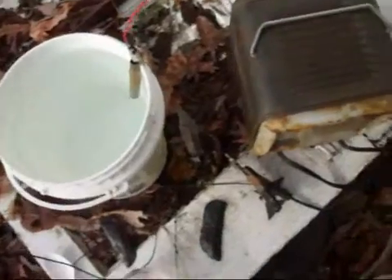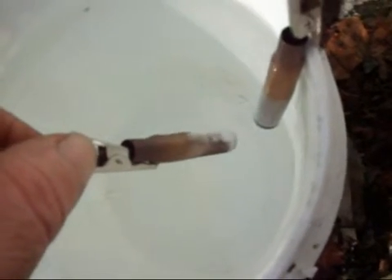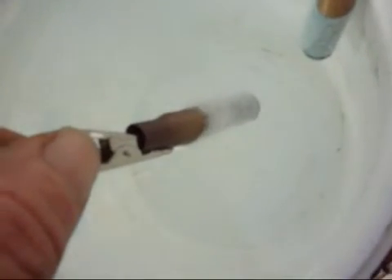Just as a test to show you that it should work — those were the graphite electrodes. What I got here is two empty brass casings from a rifle. If I hold them together, watch how quick — see how quick those bubbles come off of that one? That's the negative side, that's the hydrogen. Brass is acting as an electrode. See how fast that's coming off and how slow the other one is? It's actually turning that color because it's got copper in it — it's oxidizing the copper. It'll turn green. This side is actually producing hydrogen right there, and that side is oxygen.